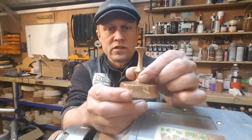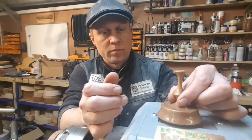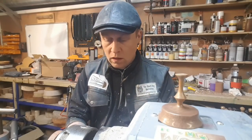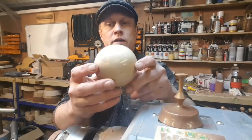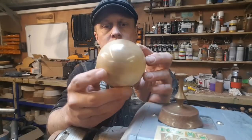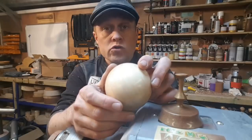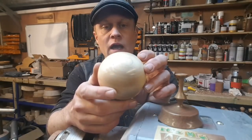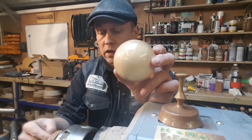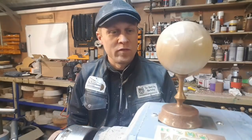After I turned the sphere, I made this little kind of posh golf tee — a little stand for it — out of a piece of sapele, and then just finished it with Hampshire Sheen Microcrystalline Wax. And here's the actual sphere itself. It's 75-odd millimetres in diameter. Nicely finished. I've got a few little sanding marks where I had a couple of issues with the cup chucks, but I'll get those sorted in time for the video. And then it was just sealed, and then it's had a couple of coats of Hampshire Sheen High Gloss, and then buffed with a wheel in the scroll chuck. And it sits nice and neatly on top of its little stand.